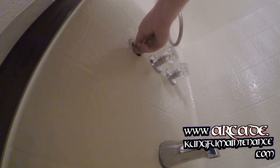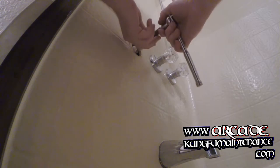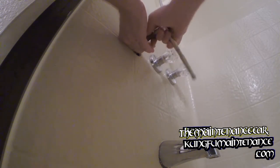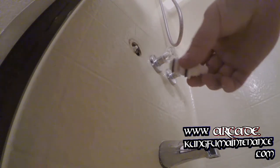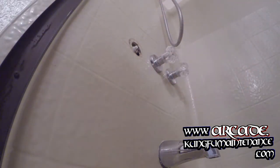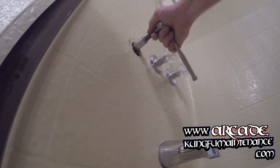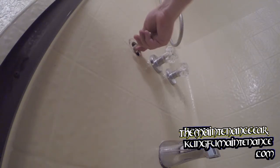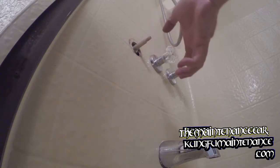Start it off by finger-threading to make sure it's not cross-threaded, then insert the new one. When you insert your new cartridge, make sure the O-ring is on the back if it has one — not all cartridges come with an O-ring. I actually like the Freedom cartridges that come with the O-ring; you just have a lot better experience, lasting time, and survival time.